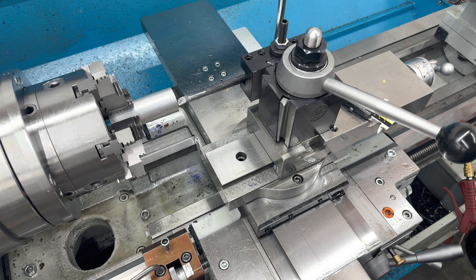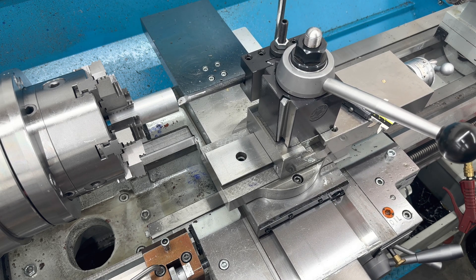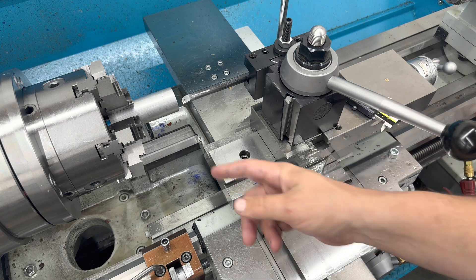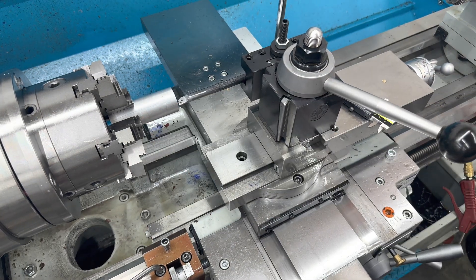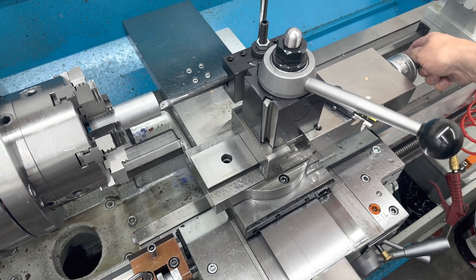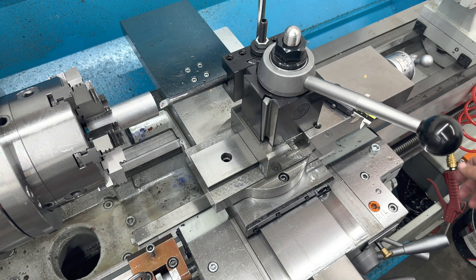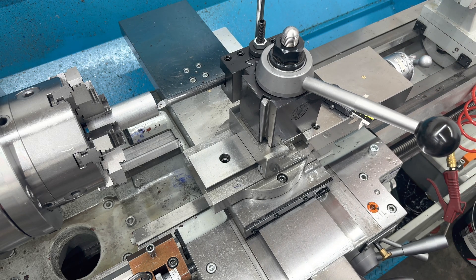I always set a carriage stop. The reason being, we can move this back and forth to get where we're at and then have a hard stop there. Remember, we're cutting at an angle, so if we move the carriage over it's going to change our depth of cut inside the pipe or sleeve. When I set this up I'm always all the way back against the stop. So if we need to get back to zero, we back it all the way out and then move in until it starts cutting — it will always start at the same spot. If we need to take out more, we just move the carriage this way.